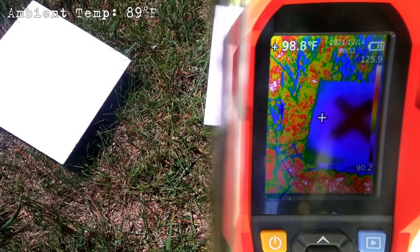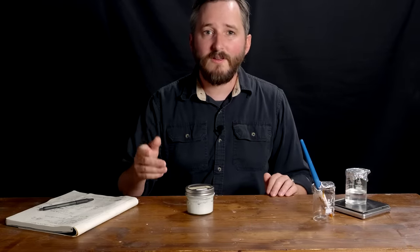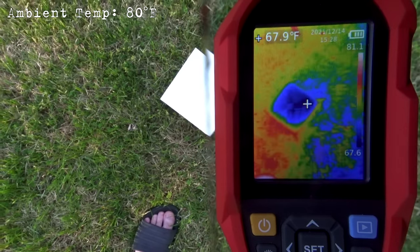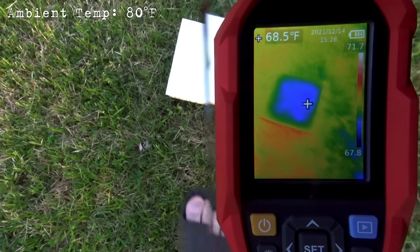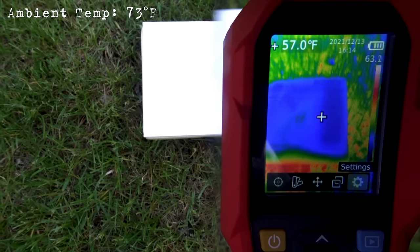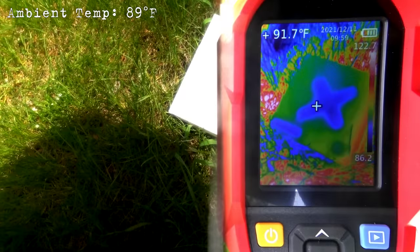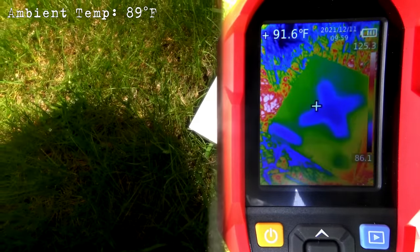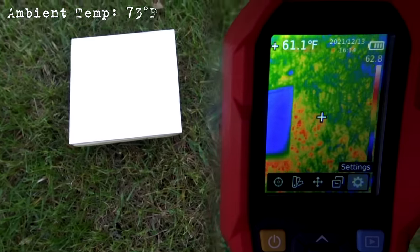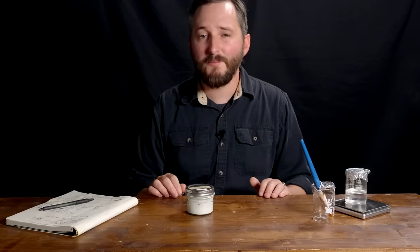Even so, I think it's safe to say this is better cooling than you can probably get with any other paint currently available for purchase. Subambient temperatures are important for this to be useful. Noonday sun is only around for a small sliver of the day, so let's try some tests with indirect sunlight and see if we can hit subambient numbers. This next test brought some unexpected results. My paint is currently a few degrees colder than air temperature here in the shade — subambient. But so is the commercial paint. My paint might be slightly colder, but not substantially. Despite not matching with the infrared window, it seems normal titanium-based paints can work pretty well for subambient nighttime cooling. Still, barium should be able to do much better, and all I can think is that I've not added enough pigment.